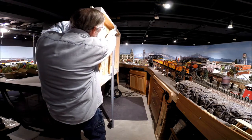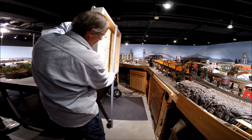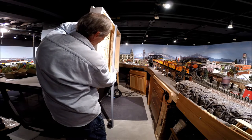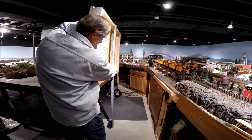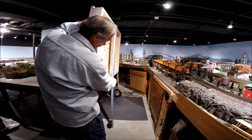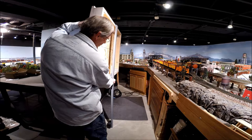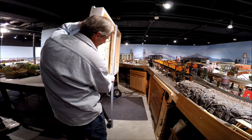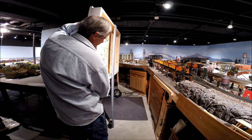So you can kind of see here, along here, where I have this 1-inch by 2-inch steel tube. It's actually painted smoke gray. It's an enamel spray paint that I had laying around the shop. I have it mounted permanently into the swing-up section of the gate with carriage screws this way. They don't extend through the plywood through the thickness of the 2x4. And on the bottom here, I have welded on some cut pieces of angle iron with holes drilled in them, and I have longer carriage bolts that basically screw up into the 2x4 piece that runs front to back here. It's a little bit of overkill, but I like the design that way.